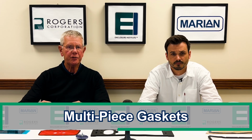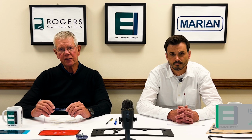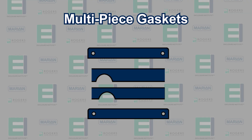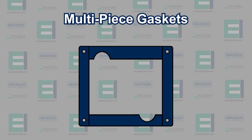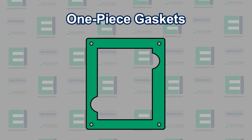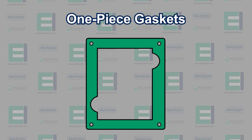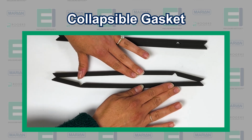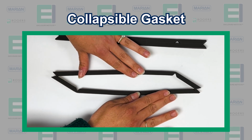The last geometry issue we'll discuss has to do with gaskets that are composed of multiple pieces. The joints in a gasket that is designed in multiple parts can create leak paths. The motivation to make a gasket of multiple parts is most often for large gaskets, such as door gaskets on large enclosures, when the cost of a continuous gasket without joints is prohibitive. As far as solutions go, I'd first say that whenever possible and affordable, design with one-piece gaskets. Of course, that's easy for me to say. But when that's impractical, you might consider what we call a collapsible gasket that must be carefully opened and installed, which can lead to its own problems, as we'll discuss in a few minutes.